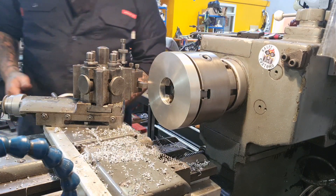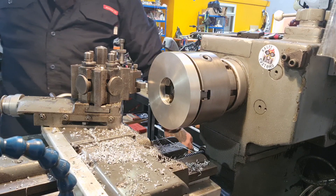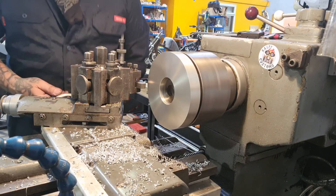There's no point in pushing everything 5.8mm that way because it's going to foul the spokes. We're just about where we want to be. So I'm just going to take that off this face, and then I think that's finished on the lathe. But now we need to do the mounting holes for the wheel, the mounting holes for the disc, and look at some relief — whether we're going to slot it or cut out or what.